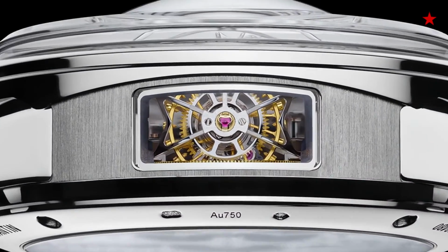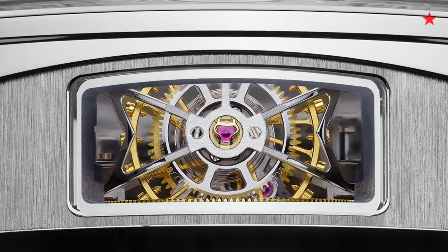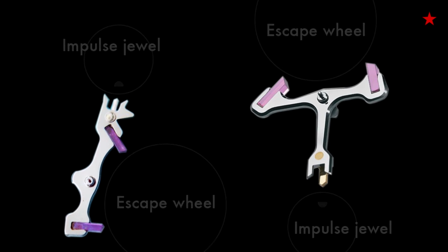Now the anchor patent. This is an eye anchor made of silicon with a thin exterior film of synthetic diamond. So exceptional rigidity, surface hardness, low friction coefficient, amagnetic. The eye anchor is mostly used in tourbillons and movements where space is very limited. It's a lot more compact than the more familiar T anchor.